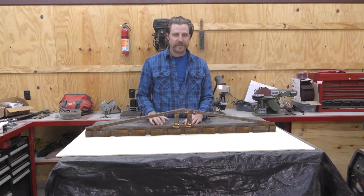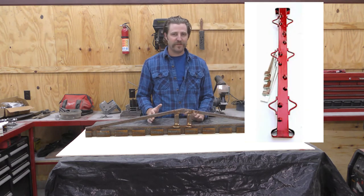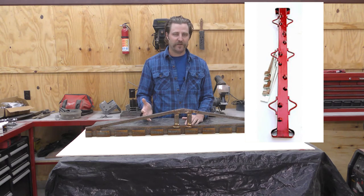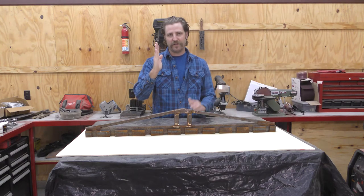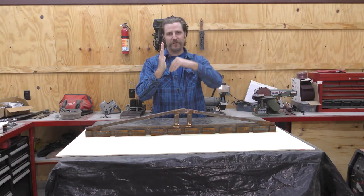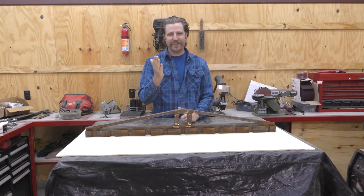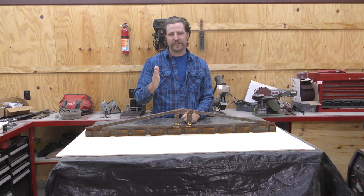The last one I haven't used at all — it's on the more expensive end. It has these removable pins where you put the posts up, put the fence in, and then slide these little locking wedges in between. It just seems like I would lose those constantly. It also doesn't seem like it puts a nice even pressure on the whole vertical line of the fence. You'll get a couple spots pulled tighter so your lines won't be vertical along your high tension fence.